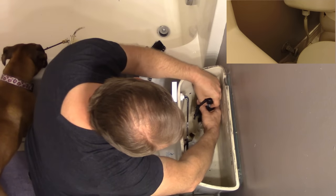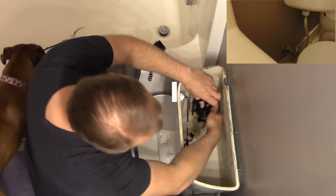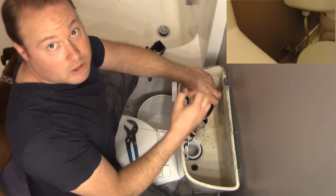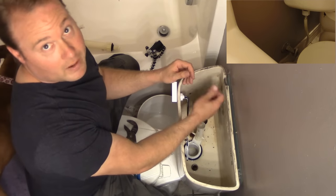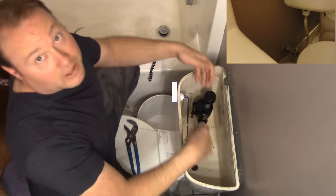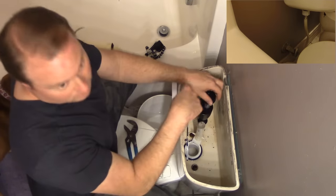There we go — it has click points there. Then you're going to slide the locking ring down and make sure that's all the way locked. Because if it's not, you turn the water on and this little guy here could very possibly shoot off and then you're just going to have running water inside the toilet that won't stop until you shut the water back off.